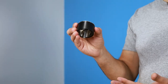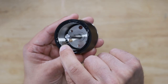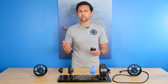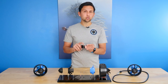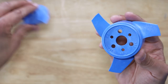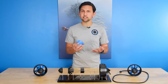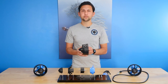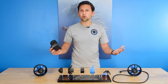The magnetic rotor is installed onto the thruster core. We've made a lot of changes here important for durability and ruggedness. You'll notice that you can't see the individual magnets because the inside of the rotor is lined with a thin metal abrasion shield to protect the magnets from debris or sand that gets into the thruster. Behind that and sealed from the water are 14 high-grade neodymium magnets, and on top of the rotor are cooling holes for water flow. The propeller is a three-bladed design, much like that on the T200, but with key improvements. We've added overlapping elements on the propeller, the core, and the nozzle to make it more difficult for particulate, sand, and seaweed to enter and jam the thruster. The nozzle is designed to be more optimized in the forward direction, since many users use our thrusters on surface vessels and other applications where forward-optimized thrust is preferred.